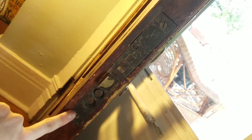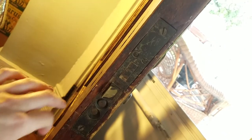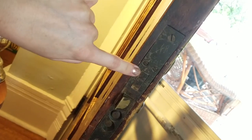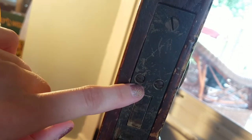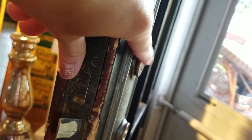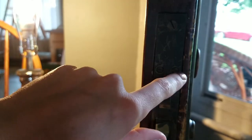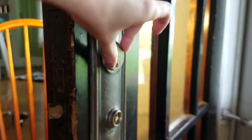This here is the edge of the door. You've got your daytime lock here, which I don't mess with much because I don't want to accidentally lock myself out of the house — some people use it, I don't. This is just the latch. Here's where the little deadbolt comes out. And these two little screws right here are set screws for the cylinder lock. If you're going to remove this — which if you want to change this plate out, you're going to have to take this out — you will unscrew these just a little bit. You really don't need to unscrew them all the way. Just loosen them up enough until this piece starts to turn, and you'll basically just unscrew this all the way until it comes completely out of the door. Then you'll be free to remove this plate if you wanted to switch that out.